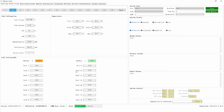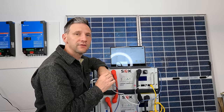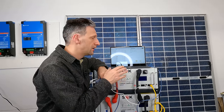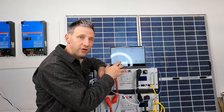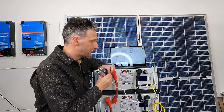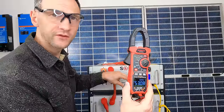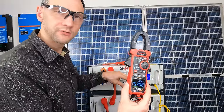I can see the voltage and the performance of every cell in the battery pack, the voltage of the entire pack, the current flowing in or out of it, and its state of charge. Battery pack 5 is still putting out a little bit of current as it tries to balance the entire stack. If there's any kind of problem, it's very easy to diagnose where it's coming from with this type of monitoring. The software to check it is free, but you do have to buy the cable to connect to it. We have 53 volts — the pack is set up and ready to go.